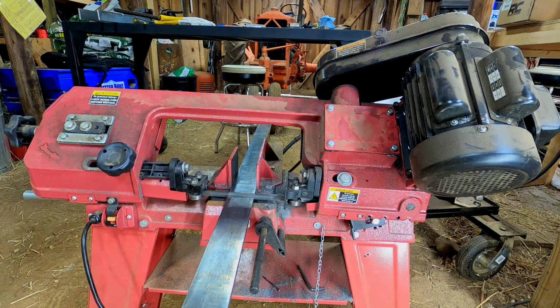Okay, so I got my two pieces of steel. I'm going to end up welding them together like this, creating a 90-degree, and then I'll weld these in the arms at whatever distance I need for my cylinder to mount up to. And then once those are welded in, I can work on getting supports made. That will end up sitting center on here, welding tight on the bottom and tight on the back. I'll make these taller so that the radiuses for the cylinder will clear this, so it'll probably end up being another inch and a half taller when I make my supports. We'll lay that out. But I think our next step is to tack these two pieces together and probably start fabricating our cylinder supports.